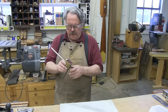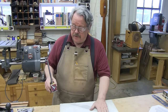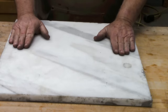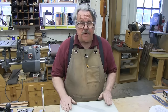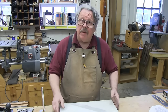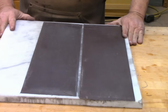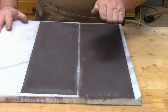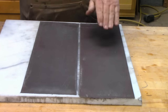With the back and the front relatively flat, it's time to move to my sharpening rig. This is a pastry stone, a piece of marble that's been ground perfectly flat and then polished. It's perfect for sharpening plane irons and lapping plane soles — you just stick down a piece of sandpaper and weight it. I've attached two sanding belts here: a 120 grit and a 240 grit. I'll start with this.